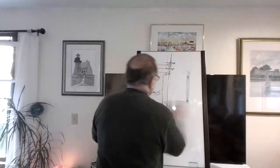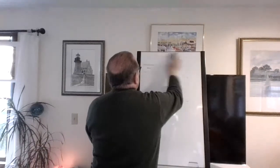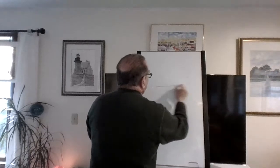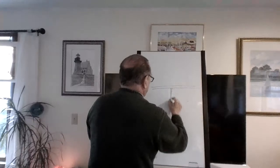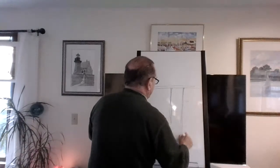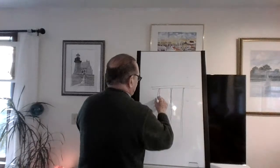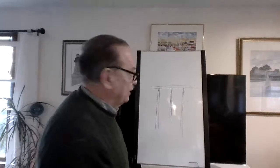Okay, while we're talking about construction, Silcock done. Let's take a look at water closet. If anything, this happens just as often or more often. All right, looking at a house, here's the outside wall right here. Now looking through the floor, which we can't see, of course, we've got our 2x going every 16 inches. Something like this. Those of you who've done a number of new houses, it's just a matter of time before you're going to nail one of these with your water closet roughing-in hole.